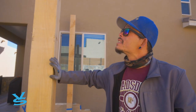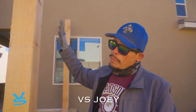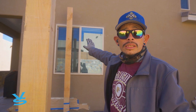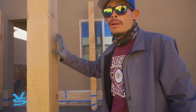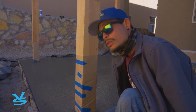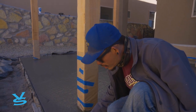We got our uprights in. These are going to be our columns for our pergola. They're already set with a slope — we're going to do a pergola with a metal roof on top, so it needs to have a slope so that water, snow, or whatever lies on top has somewhere to drip off. This one over here is two inches higher than the other side. We dug them down two and a half feet so they're embedded in the concrete and in the ground, and it's going to be stable. Even if we have 100 mile an hour winds, these posts aren't going to come out. Now we just wait for it to set up, give it a nice brush finish, and take care of any imperfections so it looks nice and professional.